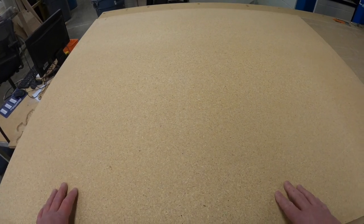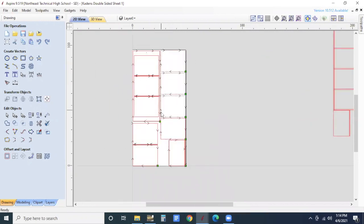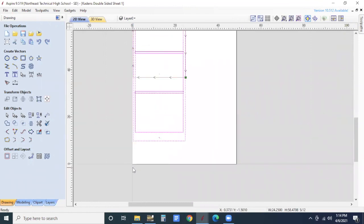We've run our first piece and I'm going to delete the extra pieces in the software — just deleting these other parts for now so I can recalculate the toolpath to show only what I want. I don't want to cut at the far end of the machine. I want to be working down here at this corner, because this is where X and Y are homed, so I'm going to move the design down a little bit.